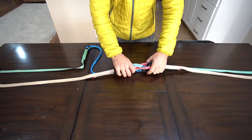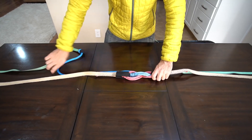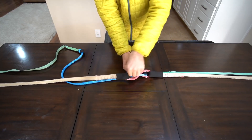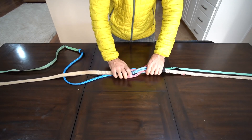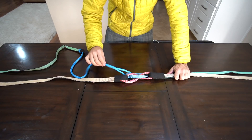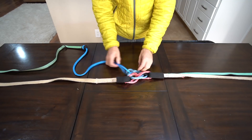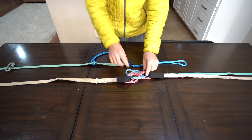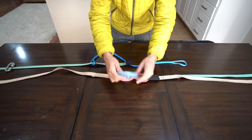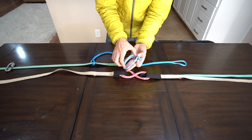Tighten that up and get it all taped up. You would tape here and here, and what you want to do is tape the soft shackle throat right there, then put them where they go and tape the whole thing after that. That is only two parts - something you can get at home for only a few dollars and make pretty simply. Make sure you stitch this or do a Brummel lock. Slackinov sells these in three and five meter lengths in case you want to buy their method. They have soft shackles for this too - a seven inch inside diameter on the red one, but five or six inches would be better. A four inch diameter soft shackle has four inches of inside space which is too small.